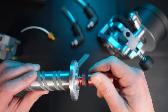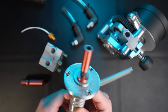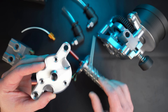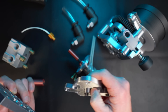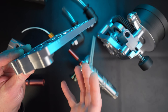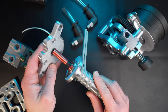We're gonna remove that heat break and put the new one on, and we're gonna reuse the same bolts that are with this, but we're gonna use a new adapter plate. This is gonna be the adapter plate for the VZ print head — it's also gonna be compatible with the VZ print head on the Rat Rig. But it's not gonna be for other printers, because we absolutely need to have the full aluminum print head to act as a giant heat sink. This part here is gonna go on top of the Goliath.